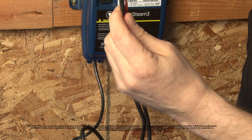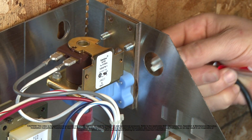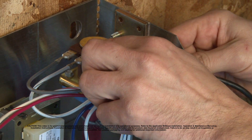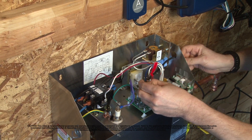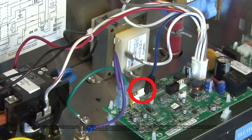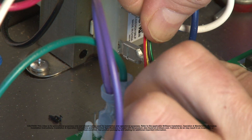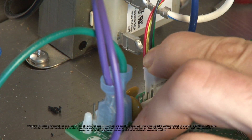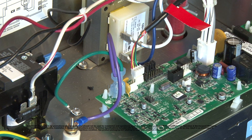This is the cable that you plug into the generator. There is a punch-out hole on the right side of the generator near where your controller plugs in. You simply pass it through that punch hole like so, and then you find this little white connector on your PC board and you take the white plug on the end of the cable and slide it in, making sure that the wires are pointed towards the back. Make sure that's stuck in good and we can move on.